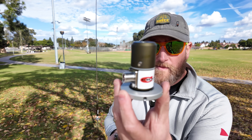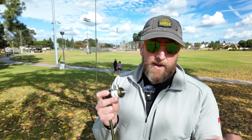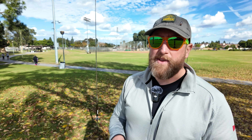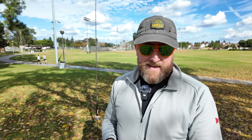All things considered, I really like this new Chameleon blank. The 17-foot whip is a great piece of kit to add to your arsenal. A lot of people go out in the field with wire antennas and that's wonderful — they work really well — but I like resonant antennas. The same goes for a vertical: if it's resonant, you can do a lot with it. I used the radial donut for convenience, but you don't need that — just use a ring terminal connector with a bundle of wires, about four, 12 feet long. I hear Chameleon is working on a slightly longer whip that would eliminate the need for the extension rod. Links in the description. It just came out — can't beat it for Parks on the Air, particularly even QRP. I'm Josh, KI6NAZ. Thanks for watching. 73.